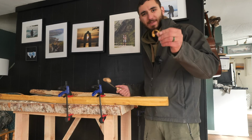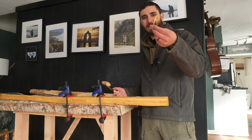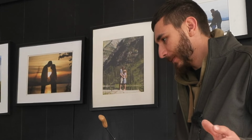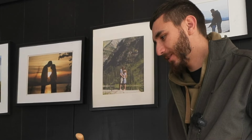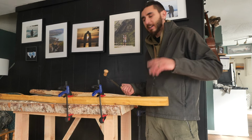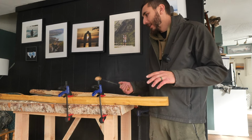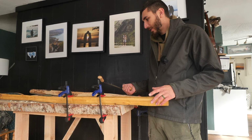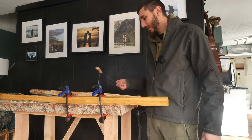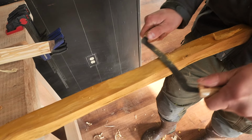Yeah, I gotta say, that's probably the nicest wood I've ever worked with as far as using a sharp knife on wood. However, I'm having a very difficult time seeing the rings so far. Part of the reason is because the oxidized wood on the outside is dark, and so anywhere I cut is a different color. So I'm gonna actually have to take wood off of the entire backside of this bow and then look for the rings.